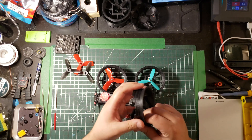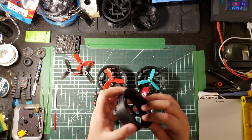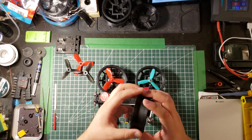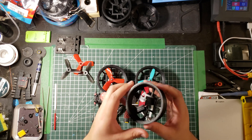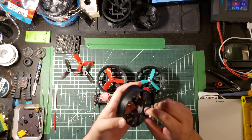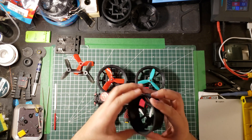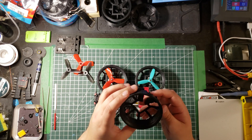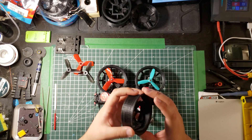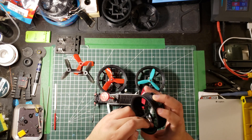The problems I faced originally were tied to weight. I tried a bunch of different filaments to get them lightweight and durable — there are some compromises. I tried PLA first, then ABS, TPU, and Nylon — all with varied results. ABS gave me shrinkage and warpage issues so the results weren't consistent. Nylon was good but also very fragile because it's very stiff, so the wrong type of ding and they would chip.